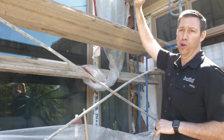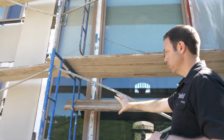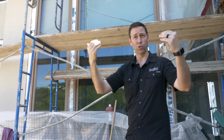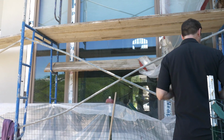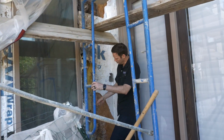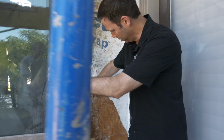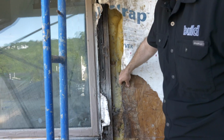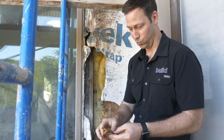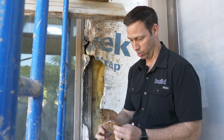We have about a 2-foot overhang. But in particular, this first story is pretty exposed. We're facing west. This is the way the storms and the wind is going to blow in. And these windows had that same rot showing, just like that window in the front. But as we took them out, look what we found. Holy cow, this OSB is in terrible shape. This is vertical mulch at this point, or was wood, just in terrible condition.